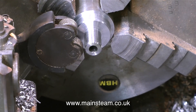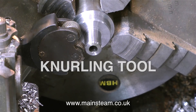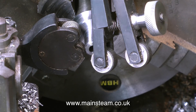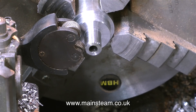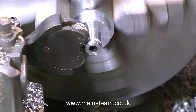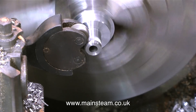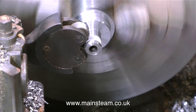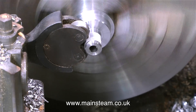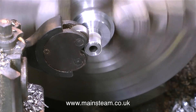This tool I've just put in the tool post is called a knurling tool and it starts with a K. There are different types of knurling tools — the one on the left is the one I use most of the time, and this other one is one that you can clamp onto a piece of metal and put less stress on it. To successfully use the tool on the left you do have to apply quite a bit of side pressure, but for a thin piece of metal you'd be better with the other one where you can just clamp it between the two cutting wheels. I stopped the lathe and readjusted the height of this tool because it's very important that both of the wheels cut, not just one.